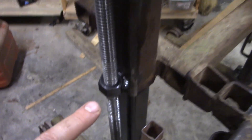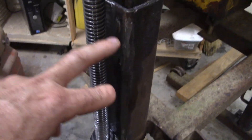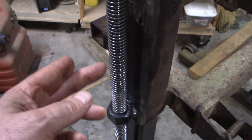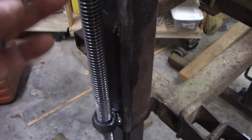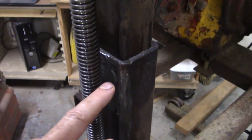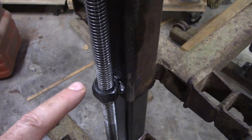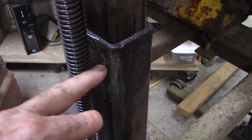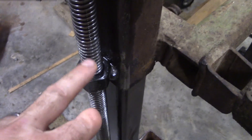You can see right here I've got some galling of the screw. What happened was on the old one I had an Acme nut and a pipe in between with a grease fitting so I could grease it. That sounds like a good idea, but over time the inside of that pipe gets filled up as it goes up and down — the screws bring dirt in and you can't clean it out. So I thought I'd put one nut here and one here so I could still clean it and just grease it in between. Well, this one apparently got a little too tight on the down stroke and it was galling the screw, and I had to cut it out.